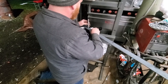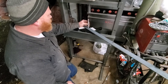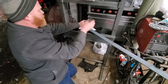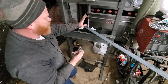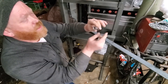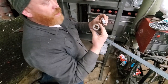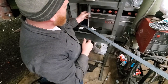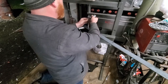Now this is dangerous — this is hardened steel, which you use for hydraulic presses anyway, but this tool is not designed for that. Just for surface area and to try and keep this straight, I'm using a half-inch to three-quarters socket adapter. I have a three-quarters inch socket here which fits right on the end of the ram.